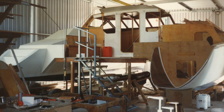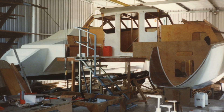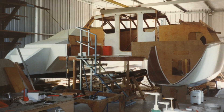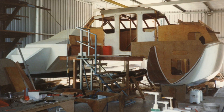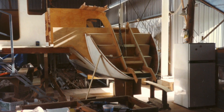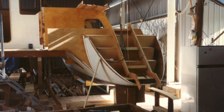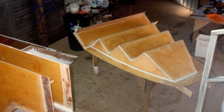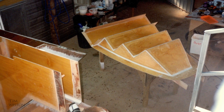I don't know how many thousands of times you go up and down those stairs getting in and out of the boat during the build, but every step counts. I made a wooden jig to fabricate the steps — the steps were made out of 9mm ply, with fibreglass tape around the corners on the inside and glassed on the external surfaces.